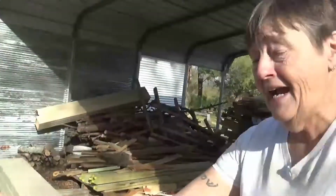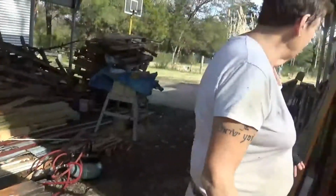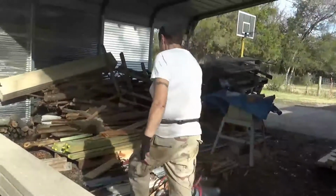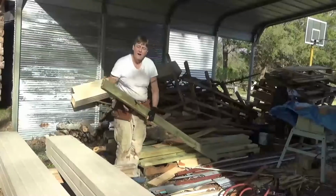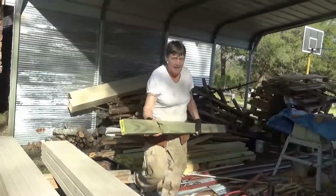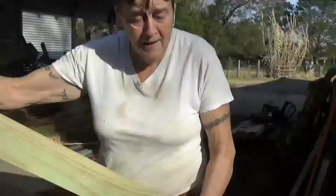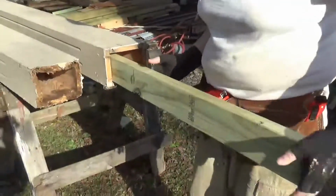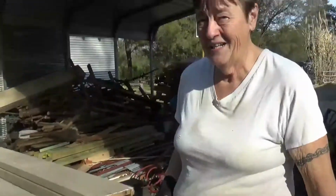But to make it strong enough, I'm going to put inside of this, on the outside edge, a pressure-treated 2x4. Attach it every which way, and then when I put it up, you'll have something to nail to. I'll have a substantial thing to put my roof line and everything else on. Right, there you go. See, what a good idea. Yeah, that's an excellent idea.